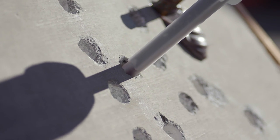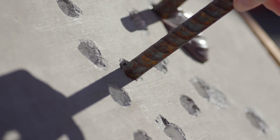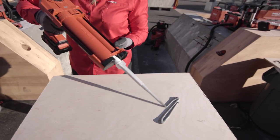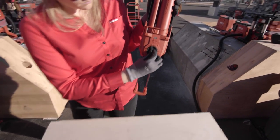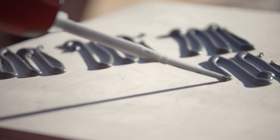We also know that not everyone needs a volume calculator app or more things on their phone. On occasion you just want to get to doing the same application over and over again — whether we're doing a serial line of rebar dowels or going between base plate to base plate. In this situation, set the dial to continuous mode, get that exact custom amount needed to fill the hole without overfilling and wasting mortar, and then repeat that custom amount consistently across the entire job site.